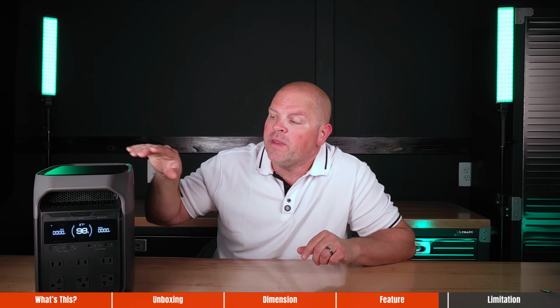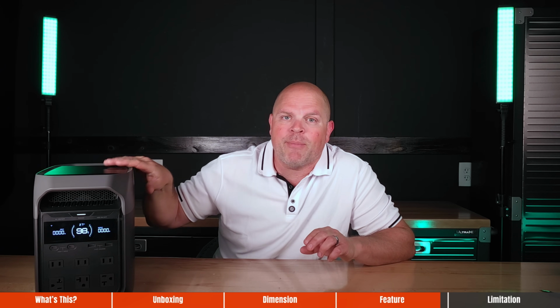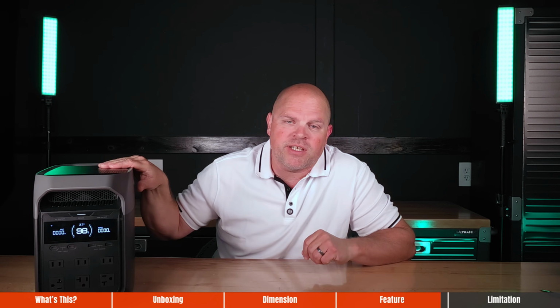You do want to make sure that you have a UPS function on any portable power station that you're buying, and the faster that it can switch over, the better. The industry standard on most power stations that I'm testing is around 20 milliseconds right now. So at 10 milliseconds, this is a step above most power stations that I've been testing.